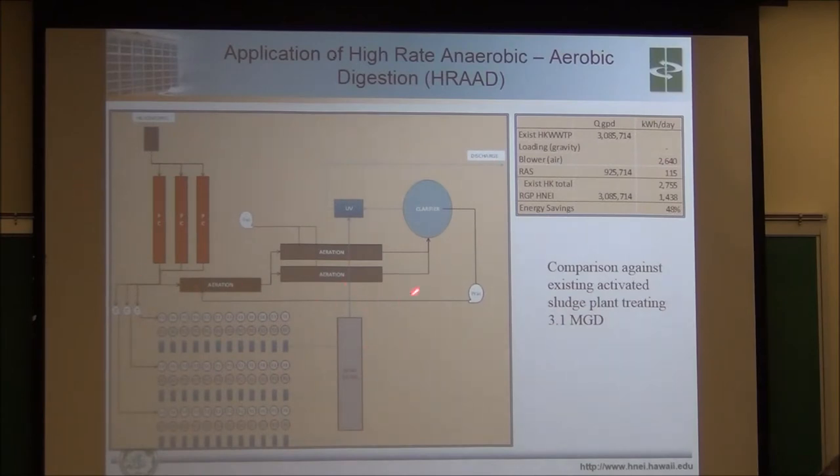Here's the basic scale of the plant. They actually have primary clarifiers that go through aeration waste basins, and they have clarifiers that go through UV. With about the same size, all of our units would just go to a large sand filter and then to UV before discharge. What we found was we could basically meet their effluent standards for half the energy. The energy savings were about 48% of the energy consumption.